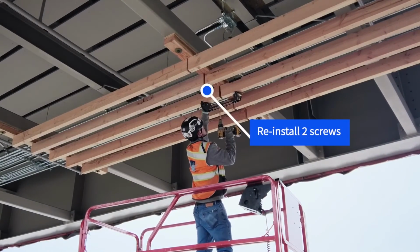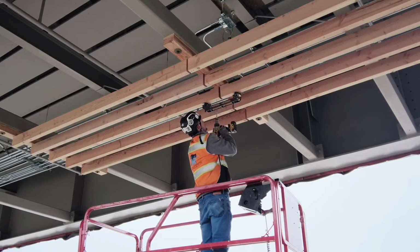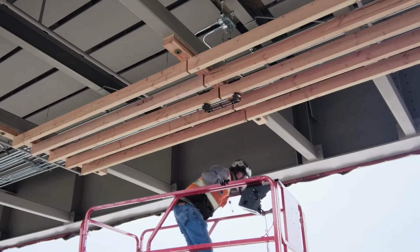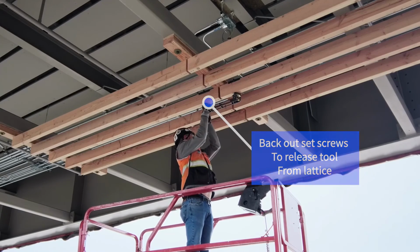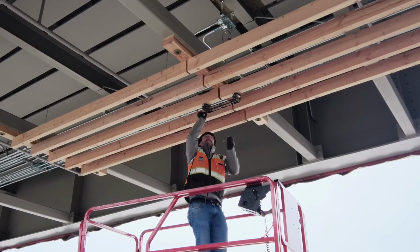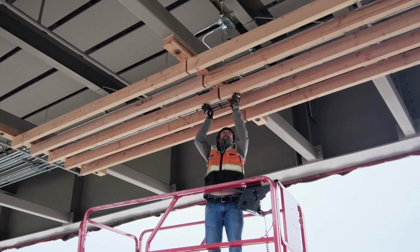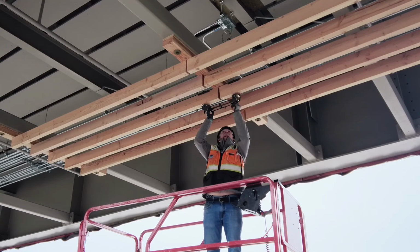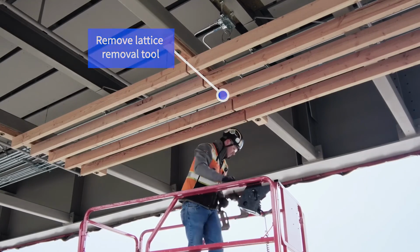We talked about doing that everywhere, but the cost was astronomical. So what we have an allowance for is 3% of the fasteners could be that alternate approach. The only places where we would anticipate any need for regular access is, in the Oregon market, that custom light fixture with the arms that sweep over all the place. The drivers for that, we were limited by where we could put them, and those are just above the lattice in between the girder. Maybe the driver's good for 5+ years. That would be the only place that we know of that would need regular access.